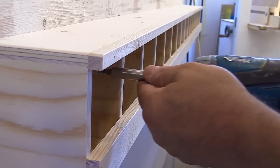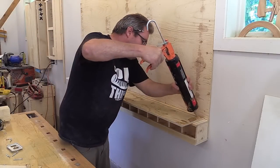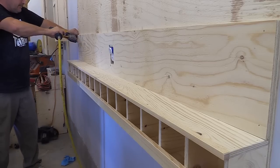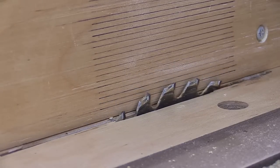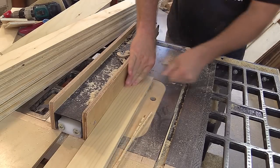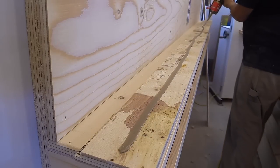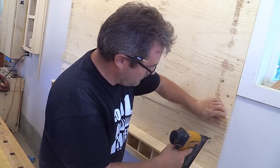These work to hold the bins unit in place and the backer board up on the wall. The first panel to install above the bins is the eight-inch strip I cut earlier, and it's attached with construction adhesive and three-quarter-inch brads. Here I'm lowering my blade and adjusting the fence to cut a rabbet in the back of all of the slats. Now I've cut some half-inch spacers. I'll get some glue spread and drive more three-quarter-inch brads to fasten each slat, making sure they don't go all the way through the backer board and into the wall.